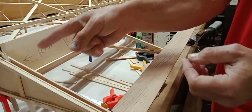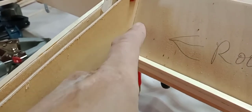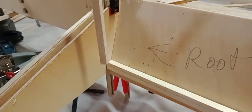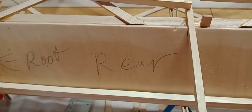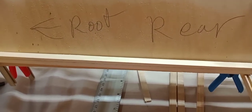We're going to glue right here too, right where it comes into the corner, so we'll glue that up real good first — get all the butt joints first, and then glue the end. I'll cut a piece — this piece here is good enough, this will be one of my corner pieces. Either that or I'll just cut a piece of this spar cap and use it for a corner piece right there. I've had to use a paintbrush to knock all the dust off this — I guess it's the humidity in the air, it's just a little bit hard to get the sanding dust off the glue joints.